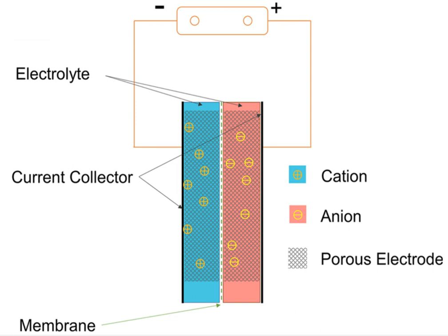In 2015, Alstom announced SRS, an energy storage system that charges supercapacitors on board a tram by means of ground-level conductor rails located at tram stops. This allows trams to operate without overhead lines for short distances. The system has been touted as an alternative to the company's ground-level power supply (APS) system, or can be used in conjunction with it, as in the case of the VLT network in Rio de Janeiro, Brazil, which opened in 2016.